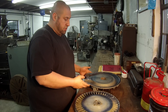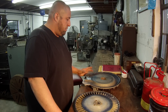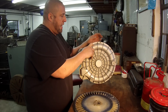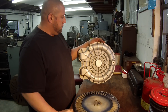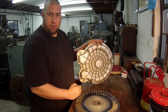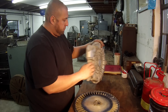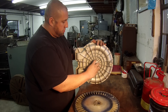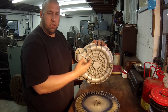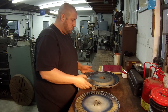This is going to really stretch the limit of the Monarch lathe. I haven't even checked to see if it's going to swing yet — my measurements are telling me it's going to be really, really close. This is where having the big lathe always came in handy. I could have chucked this up out here on the outer flange with that big Cushman chuck and got it indicated really easy. But there is a boss right here that I think I can chuck, and I'm going to attempt to grab it. It's aluminum so it'll bite real good.